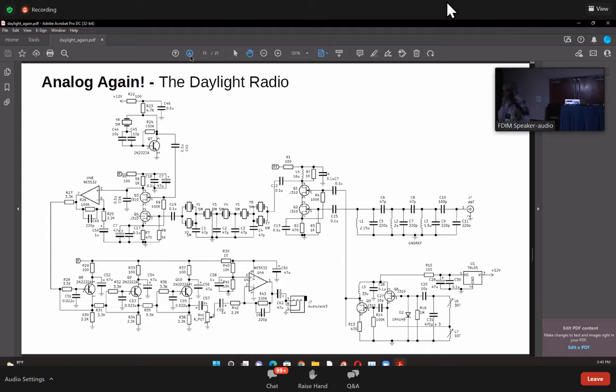Two-tone test. And two-tone test is actually pretty easy to do. A lot of people think that you have to build a two-tone generator. You don't have to do that. Go to onlinetonegenerator.com. Open it in two windows, 700 hertz on one, 1200 hertz on the other, and you're done.